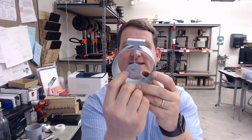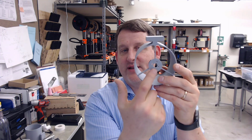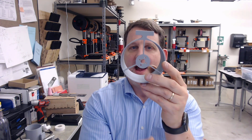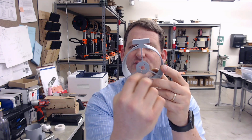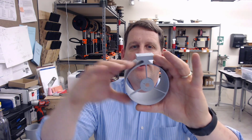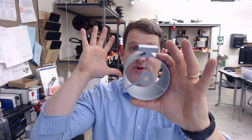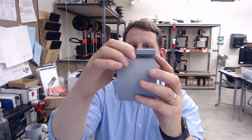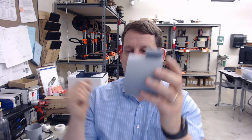Right, now that we've got the motor in our program, we need to create the plastic housing around it. We're going to start by creating a sketch of the back, using the back of the motor so we can capture all these different holes exactly where they are. And then we're going to extrude that center circle out. Then we'll add the arms and then the outside shroud and then the foot and everything to it and extrude out that way. Notice how the foot starts at the back and extends only part of the way towards the front. We'll get all of that done.